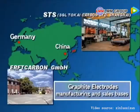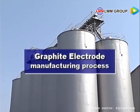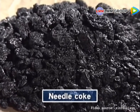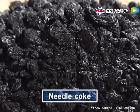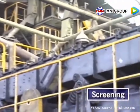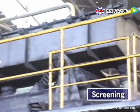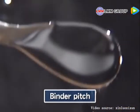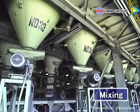This video will outline the graphite electrode manufacturing process. Needle coke, the main raw material of graphite electrodes, is crushed and sieved to optimum grain size. Binder pitch, an auxiliary raw material, is added and then mixed with a kneading machine in predetermined conditions.